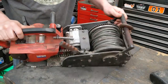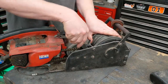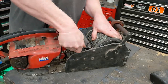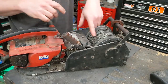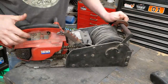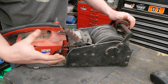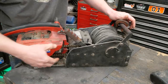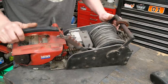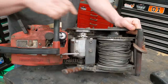The way this works: there is a brake, so this is a brake and then the drum just free-spools. Lock the brake back on so it doesn't — you unlock the brake and all the cable just wants to jump right off. But you have the chainsaw and it'll have a little clutch in there. It looks like they use just a standard chainsaw chain clutch, and when you rev it high enough it'll spin this chain, which just spins this gearbox. I did the math and it looks like it's a 53-to-1 gear reduction.